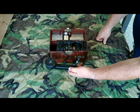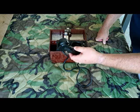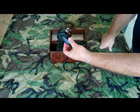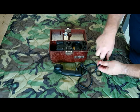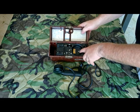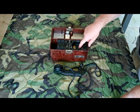The handset is very similar to what the TA-57 and the TAP-77 used. The receiver and microphone elements are probably interchangeable between those two. The handset just pops right off and pops right back in. Inside there's a screw — it's just a selector to change between local battery and common battery. I have it set to local battery now.